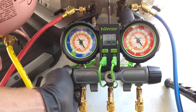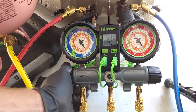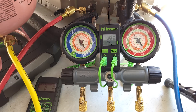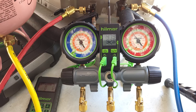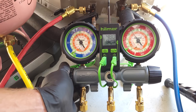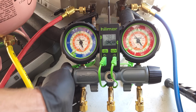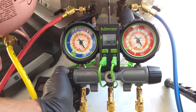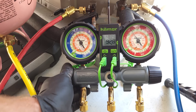We only want to do it a little at a time because you don't want to add saturated or liquid refrigerant right into the vapor compressor. Remember that this large vapor line goes right into the compressor — it's only about one or two feet of line before it goes into the side of the vapor compressor. The job of the vapor compressor is to increase the pressure of the vapor refrigerant. There should not be any liquid before or in the compressor — that's going to damage it.